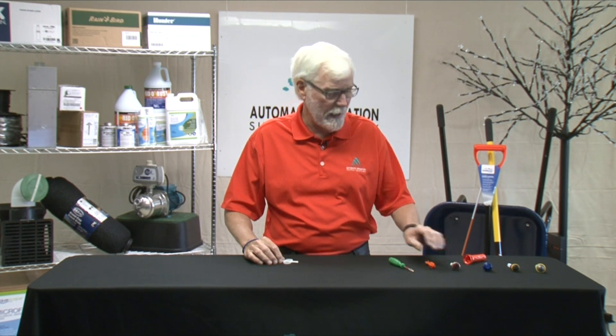Hi, I'm Steve Christie from Automatic Irrigation, and I'm going to show you how to adjust a rotary nozzle. Rotary nozzles are a relatively new addition to sprinkler lines, and the reason is that they have much lower precip rates than spray nozzles. They throw anywhere from 10 to 25 feet and can be added to rotor zones. If we're looking for additions to the sprinkler lines that would add to water conservation, these are really about the coolest ones they have.